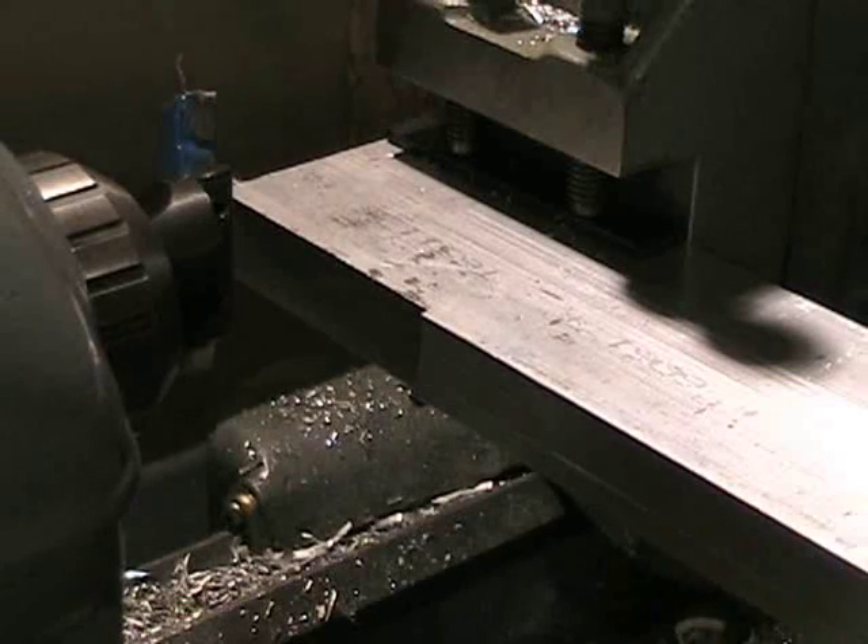You can see just how far down we've gone — about a quarter of an inch. Because I had to bolt this bar onto just a piece of channel to fit into the milling attachment, it's not super steady, so the cuts had to be fairly light — just tiny, tiny cuts. Really what I've done is milling with the drill bit to create a slot for the mounting screws for the telescope.